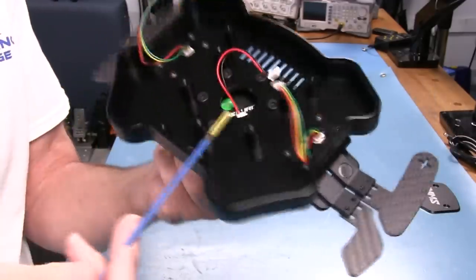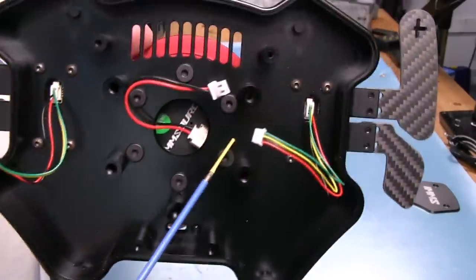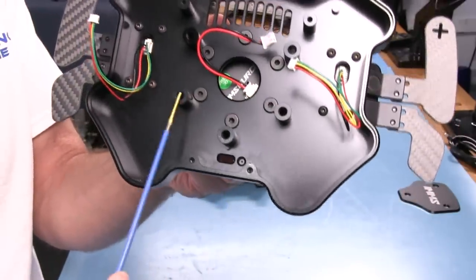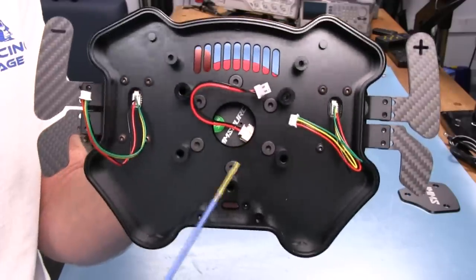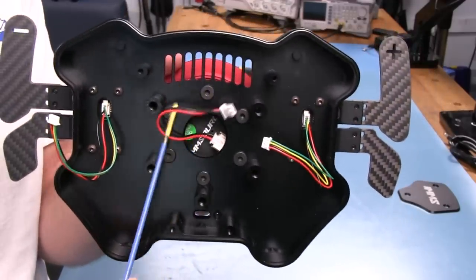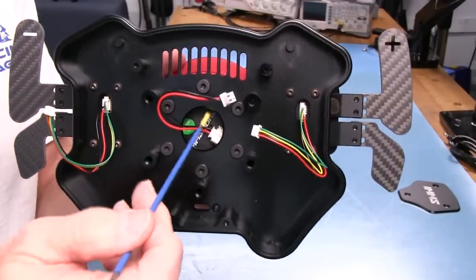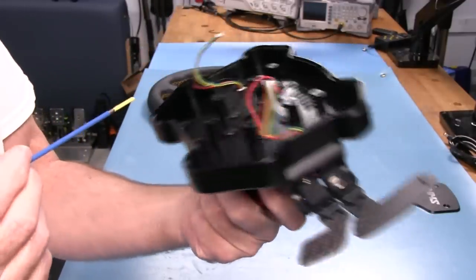So yeah, we got some nice standoffs machined into this. Very thick. Of course, they're threaded. And this is where the wheel bolts go. And five of these, there's not six, there's only five, because there's a hole here that's going to the quick release segment back there that's also housing that coil for the magnetic coupling for induction.